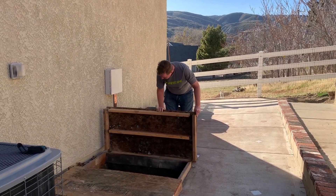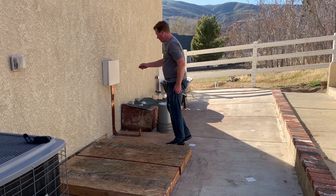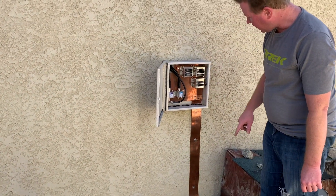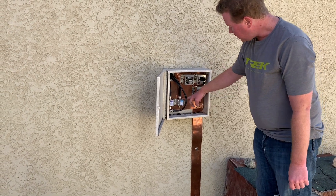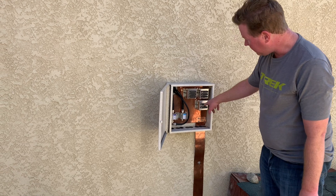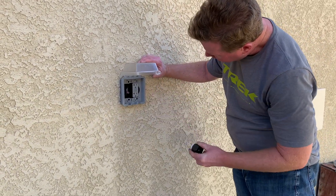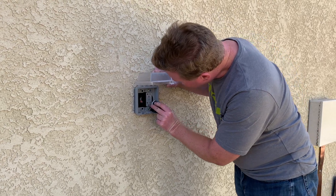I made covers to cover up the hole until I can get the tower put in. Over here is where the coaxial cables get fed to my radio room — tied with 3.5-inch strap to a 10-foot three-quarter-inch ground rod, then LMR-600 feed lines for HF, an HF surge suppressor, and a VHF/UHF surge suppressor. One feed line goes to the SteppIR DB36, the other to a Diamond X300. These are for the antenna control lines and rotor control. I also have a 20-amp 120-volt circuit that wires up to the motor, with a little disconnect.